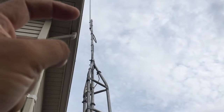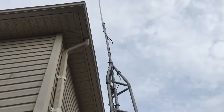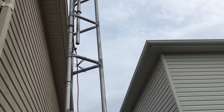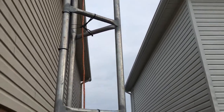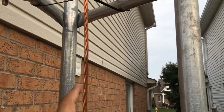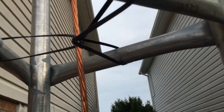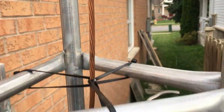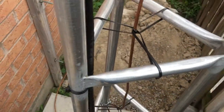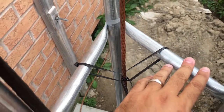Where that tuning capacitor is compared to my roof, I'm above it about 3 feet. It looks like it's the same height, but it's not. I centered my ground — it's 3-gauge copper. I used tie wraps just to center it to make it look neater. I didn't want the copper touching the galvanized metal.